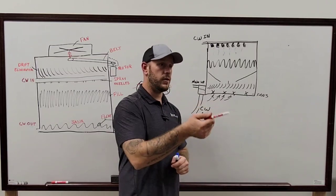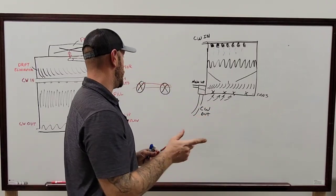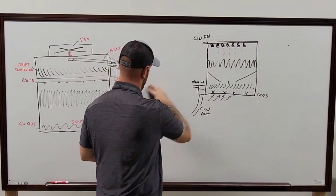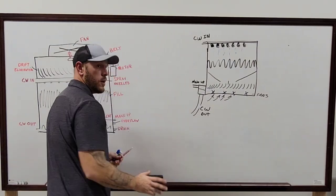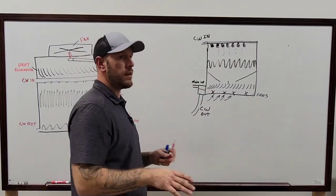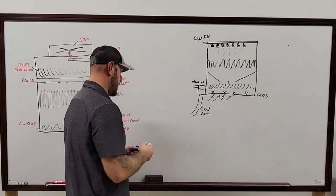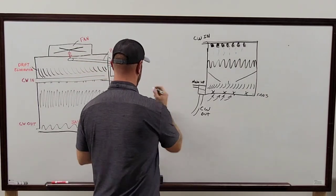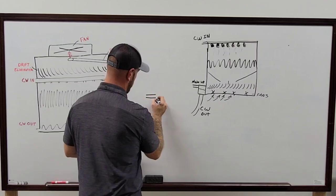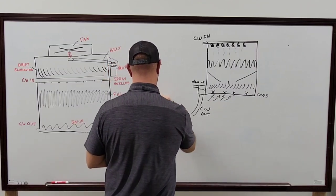Most of the time, whenever you're using the laser alignment, it depends. Like we have one here where... Well, I'm just trying to make sure I'm understanding this correctly. No, yeah. That's what I want you to do, because the alignment is super important with any motor and any fan whatsoever. It does not matter. So on your pulley, let's see, I'll draw it like this. Yeah, there you go. I was going to suggest that.